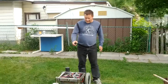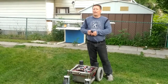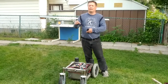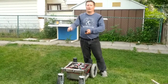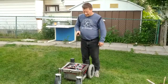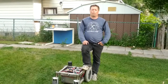That seems to work fairly well at slow speeds. At higher speeds it doesn't work as well, because you're going and then you go to turn and all of a sudden you've got this 50 turn value and it throws the motor in reverse, and then you just lay a great big trail of rubber — and that's not so good. So anything faster than about 150 I've now implemented what I call pulse reverse brake.